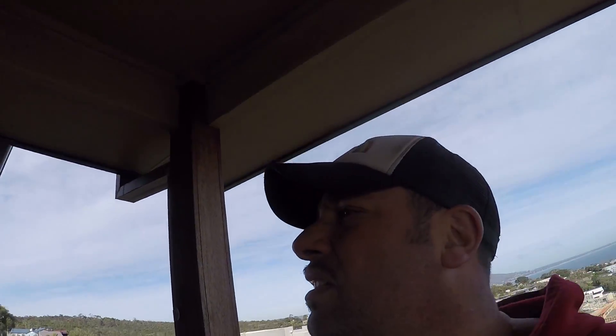Here we can see across the ceiling all of the salt that's sitting on top of this ceiling here. Look at that — that's full-on. That's why it's so important in areas like this. Look at all the salt along that. That's why it's super important that we make sure that we get rid of all of that salt. That's why we make sure that we seal everything really well, so that salt can't get into these materials, like either the cement or the timber.